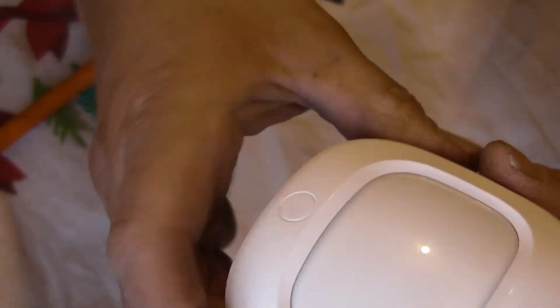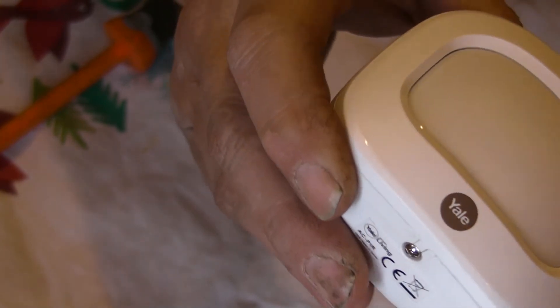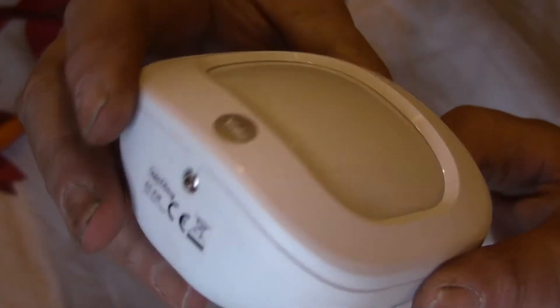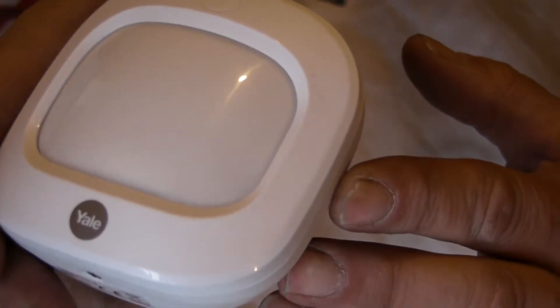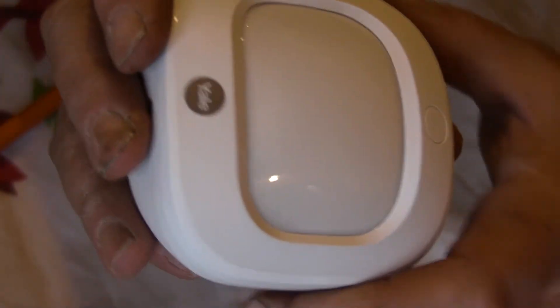Going back to the standard one. The other day I was thinking, well, what can they have done to make it a PET PIR? I thought of obvious things like they could change the sensitivity — and we'll come to that shortly — or they could screen off some of the PIR sensor. I've seen videos where people said if you turn the sensors upside down it makes them less sensitive.